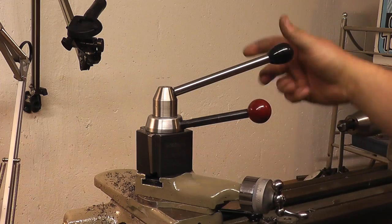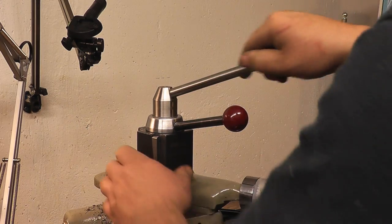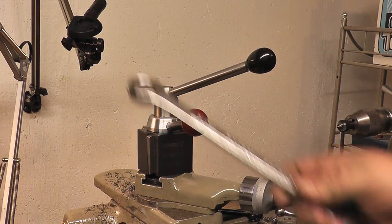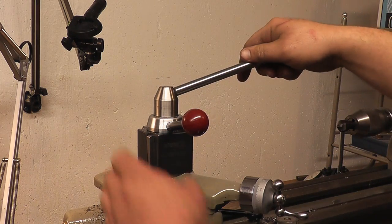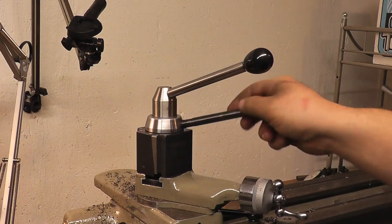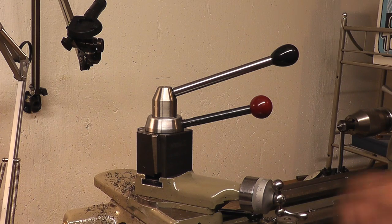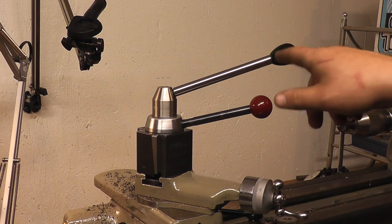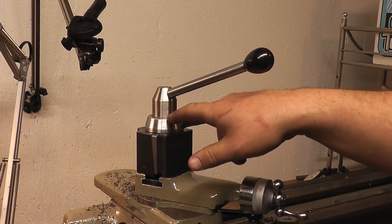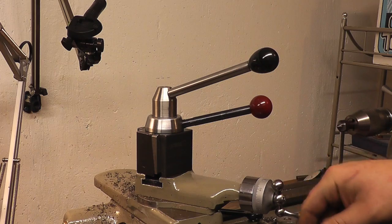But now we're always attached to the tool post, so just simple loosen and tighten, clock this around instead of hunting for Mr. Wrench. So that's it there. Like I said, we'll be using it for a little bit, and we'll see if this length is where we want it, and see if this position is where we want it. If not, worst case scenario, make a little shim to sit underneath there to clock it maybe more over this way, if anything, and we'll go from there.